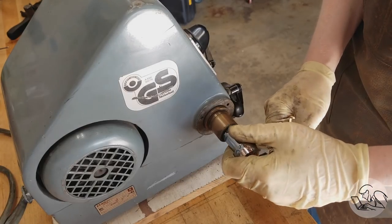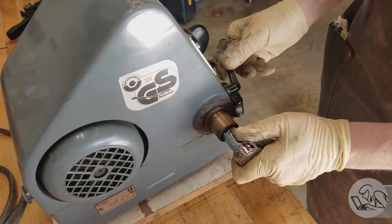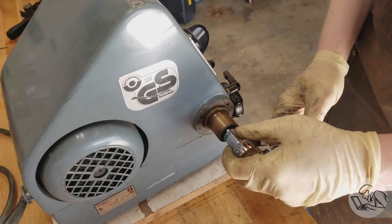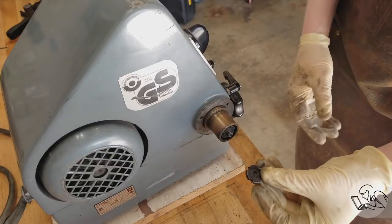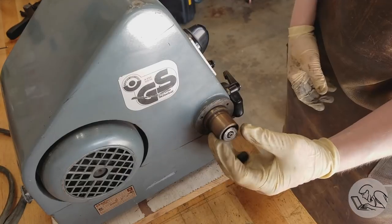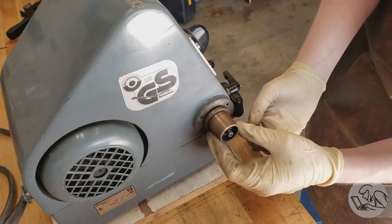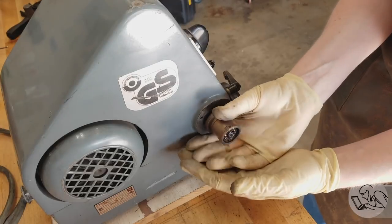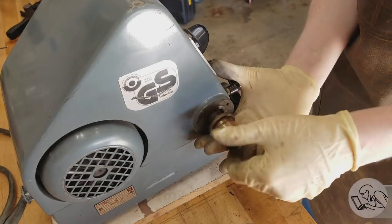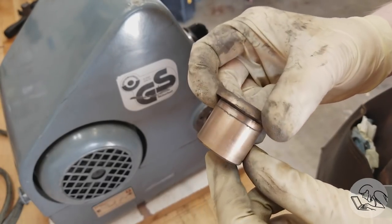Now we can use that on a ratchet handle to get those nuts out of there. I use the lock to keep it from spinning, and then it comes loose pretty easily — that guy wasn't actually very tight. Those look the same as the ones holding the workhead on, but they're a slightly different size for some annoying reason. There's also a thrust bearing underneath. So we'll keep track of that for later. Now this bronze bushing unthreads just as we hoped. Here's the other half of that thrust bearing — the thrust bearings ride against the spring tension from the cap on the other end of the bar and keep the whole assembly tight and precise.